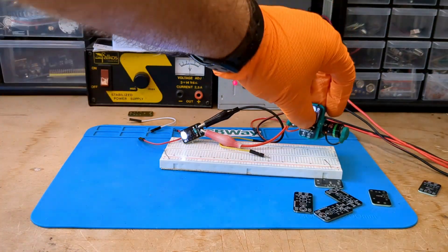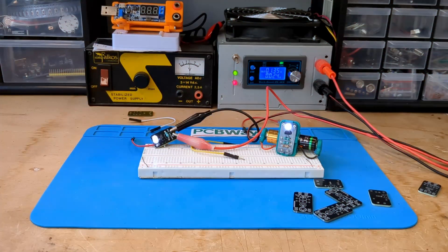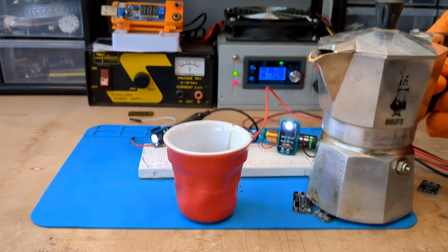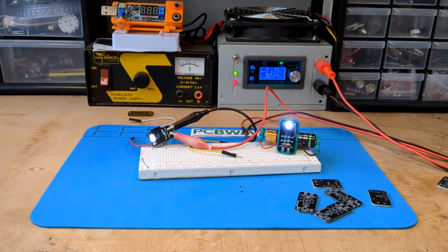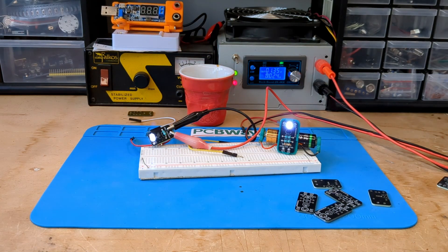Having reached this point, I have to tell you some technical stuff I did not talk about in the video. For the first circuit I used the typical Joule Thief diagram — you can find it on Wikipedia. The inductors I used are 100 microhenry. As for the resistor, you can experiment: with a 1 ohm resistor I was able to light an LED with only 0.4 volts — a good result. Of course you can experiment to get your preferred result and write it down in the comments. In the description you will find all the links to the components, a link where I explain the project in more detail, and a link where you can buy or download the board.